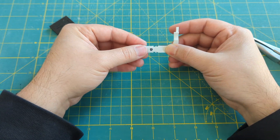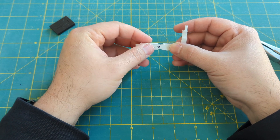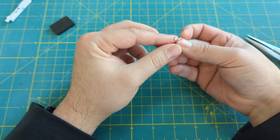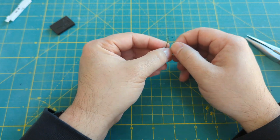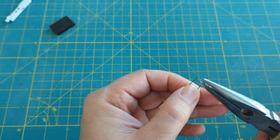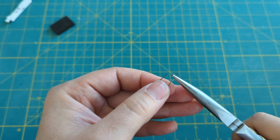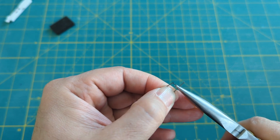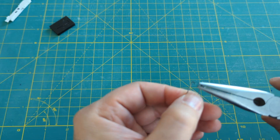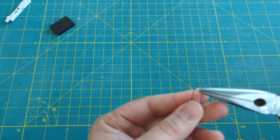Here I'm testing the spring out again and it may be hard to see, but the bottom portion of the carry lever spring is interacting correctly while the top isn't quite all the way engaged. You can see that the left leg is just a hair longer than the right, which is causing the problem, so we are going to straighten this out and bend it back a bit lower. It is hard to see here because the camera is focused in the wrong place, but I bent that leg just too far down — it is very easy to do when you are dealing with such small distances and I had to correct it.